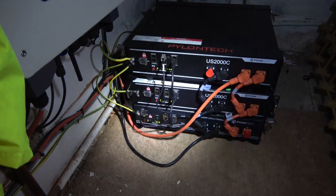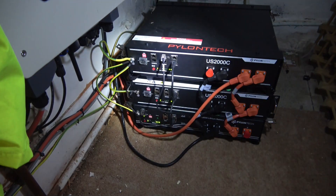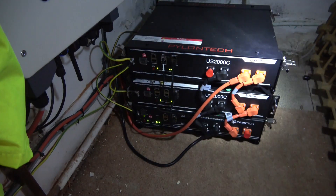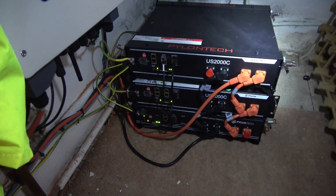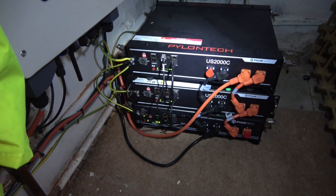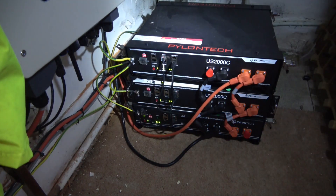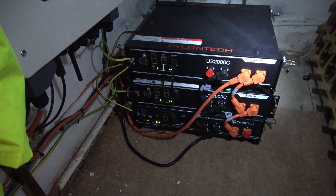In summer I have a different program because the batteries will fully charge from the solar panels over the day — they won't essentially be used after about 9 or 10 o'clock in the morning. Then they'll kick in at about 9 o'clock at night and last until the next day when they get their next charge. Should there be a bad spell of weather I can always put in a program to put a couple of kilowatt hours in just to top them up. Anyway, that's it — adding an extra Pylontech US2000 into the stack of existing batteries is no big deal.